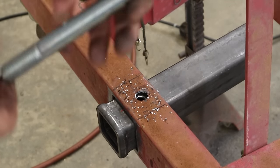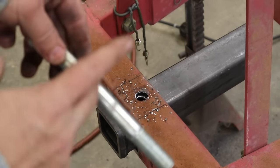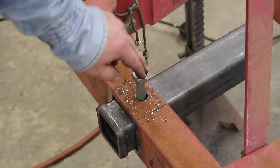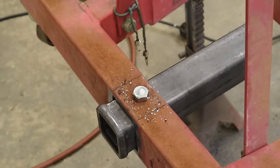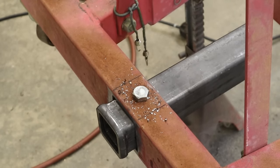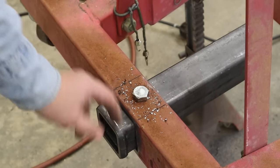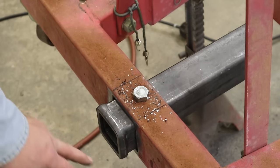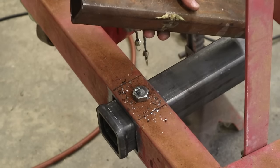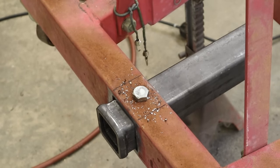We've got our pin - I'm going to cut this one off, it's a little long - and we'll drill a hole and put one of those little quick-connect pins in it. This pin has nothing to do with the receiver sliding in and out - when we weld the receiver on, this will just let us release the removable section so when using it as a regular cherry picker we can pull this out so there's nothing to trip over. There's a little gap but I'm not worried - just need this done so we can use it. We'll get good penetration welding front, back, and I'll get that other piece in for a rosette weld. Going to grab some lunch and come back for the arcing and sparking.